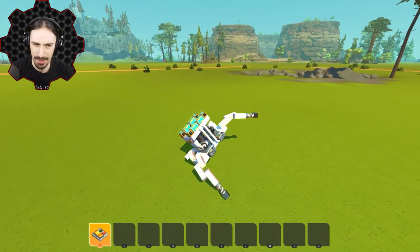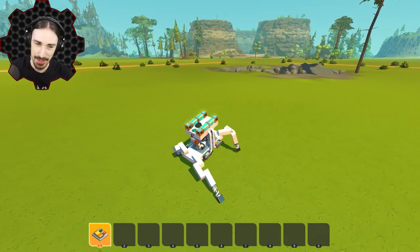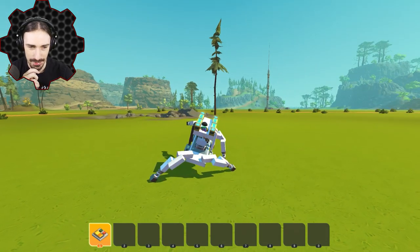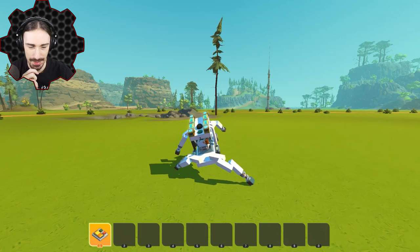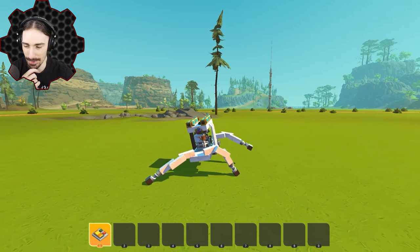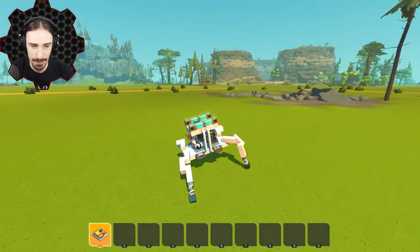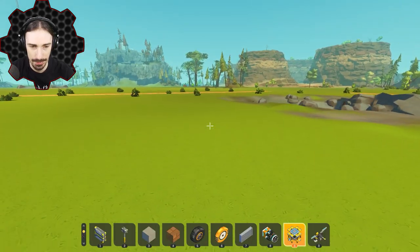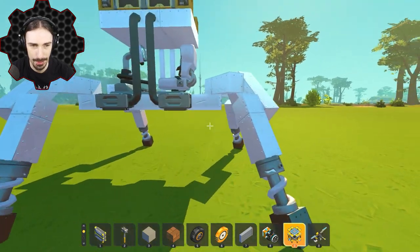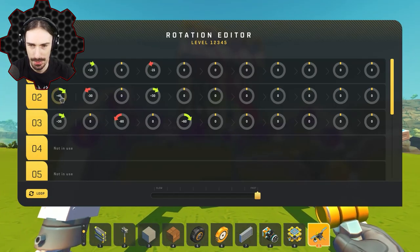We almost have it. This is walking. It doesn't look that majestic. I'll give it that. Or I'll take away that, I guess. That's not giving it anything positive there. But it now walks forward, which is progress. And you know what? I feel like the back legs go a little bit too far forward, and that's causing it to fall back a little bit. So what if the default is actually 45 degrees instead of 30 degrees? That's a little bit better.